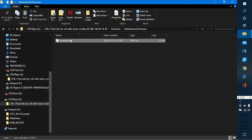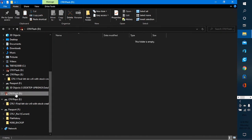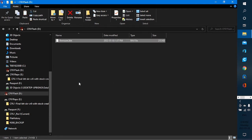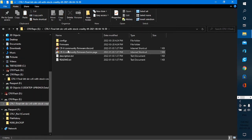There's the motherboard file. All I have to do is copy it — Ctrl+C — then navigate down to the flash drive we created, drive D, and paste. I could now take this card, put it in the printer, cycle power, and it would flash the motherboard with that firmware.bin file. That's all you would have to do to use this card to flash your printer motherboard.